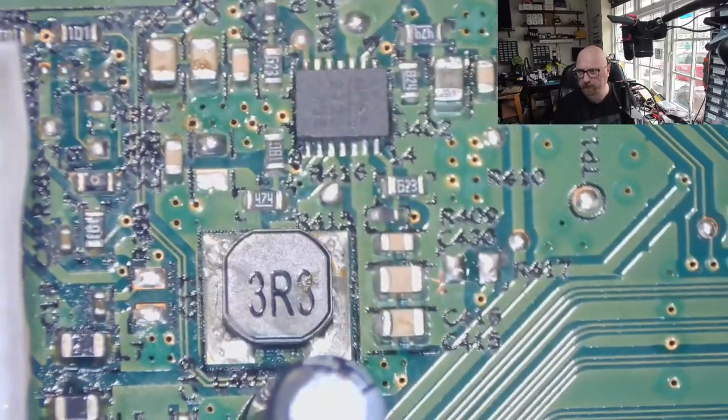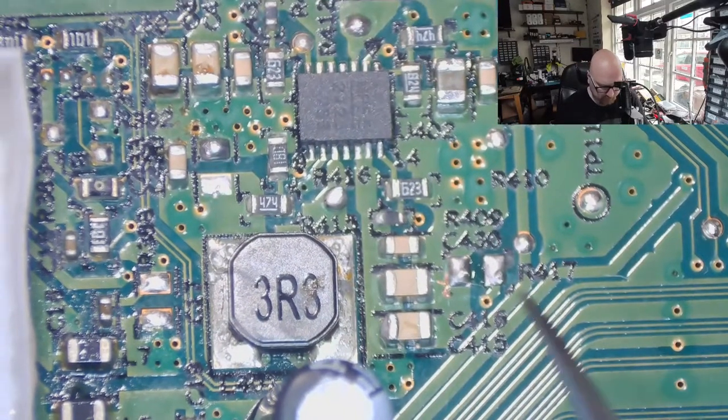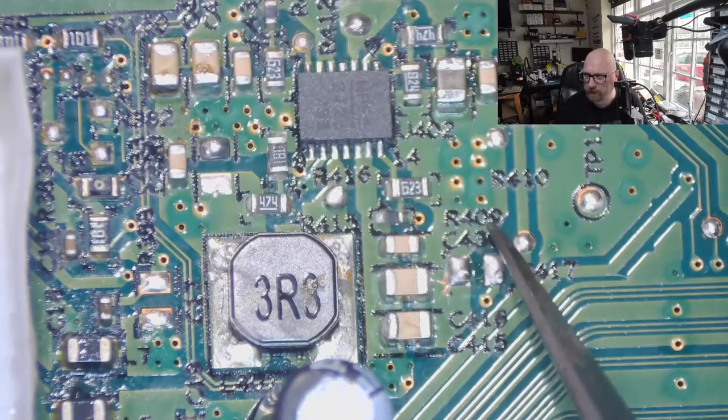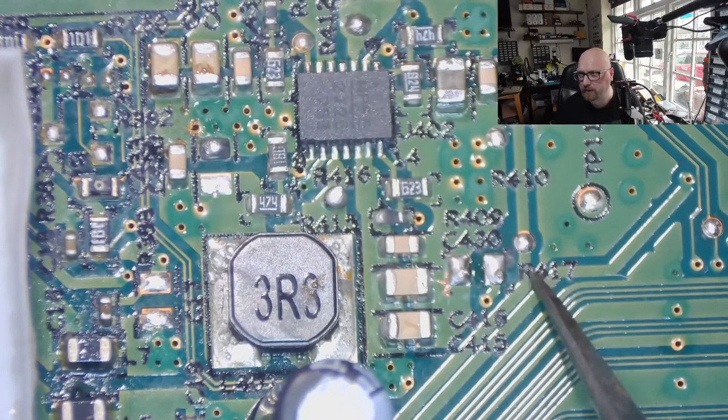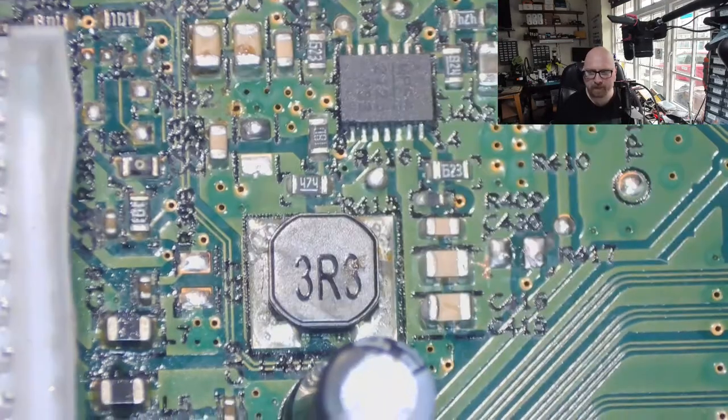Alright, so I couldn't find a problem actually, because there was no problem at all. But there's no schematics on the internet, of course, it's always like that. But I've done some research on the internet, and what I found was very interesting. On this motherboard, if I go under the microscope, what I've noticed is that here, the one missing component, I thought it's a capacitor, but actually here we've got a description. So this is the resistor, there should be a resistor here.